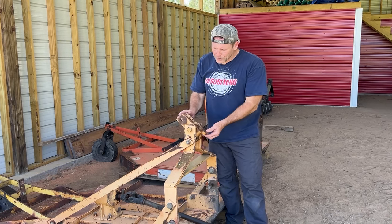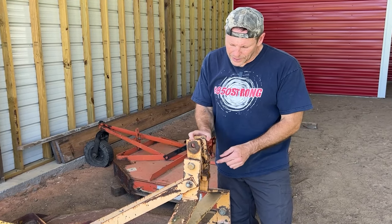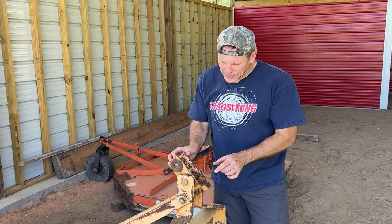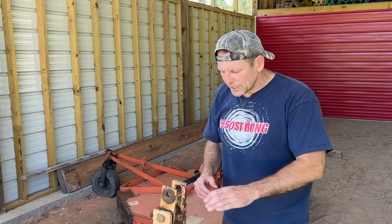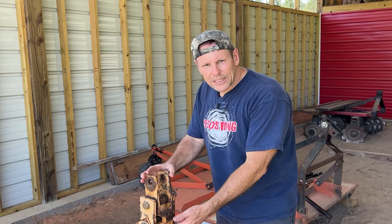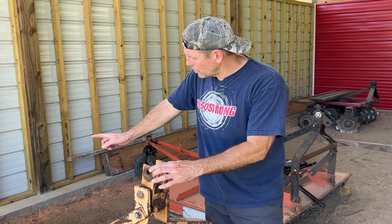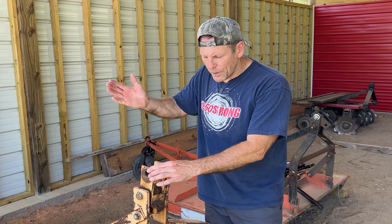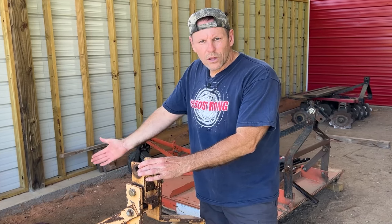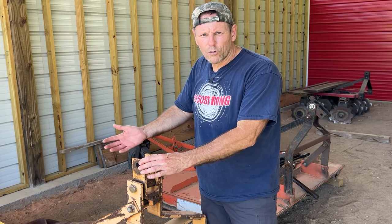This one here is actually assembled properly. You can see that this horseshoe piece right here pivots, and this portion right here goes into your top link. It has this little welded square piece right here, and what that does is hold all of the weight of the brush hog to your tractor — it rides against this little square piece. What that allows it to do is the rear end of the brush hog can then flip up, so imagine as the tractor sits still the brush hog can flip up as it hits maybe a stump or a root or a rock.